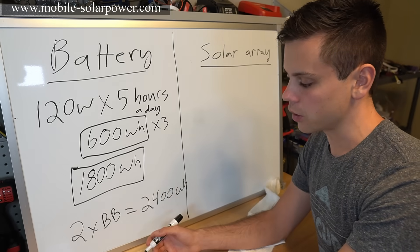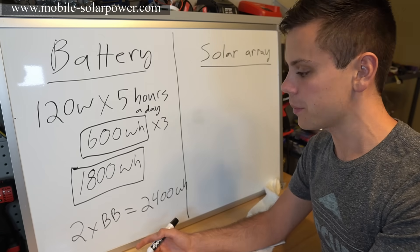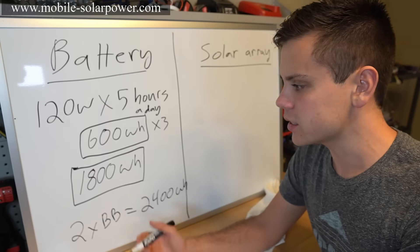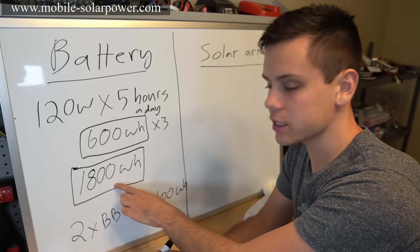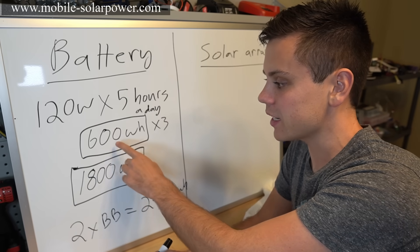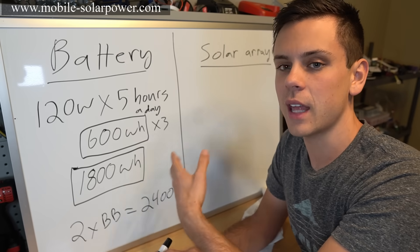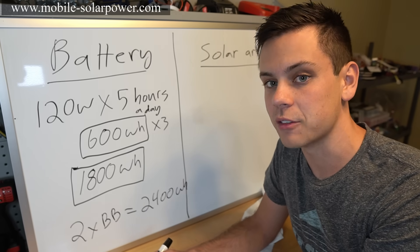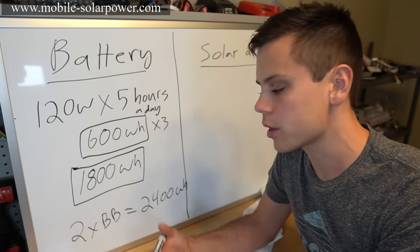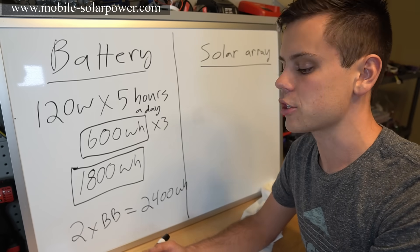You typically want to round the number up — you can't use a fraction of a battery. If you live in a very sunny location you don't need this large a battery. Here in Las Vegas I could easily power this load with a 600 watt-hour battery, because I know I'll rarely need that many days of backup. It really depends on your local weather and latitude.